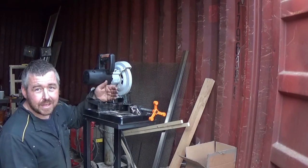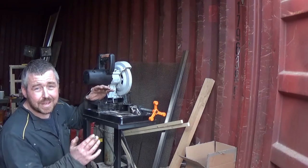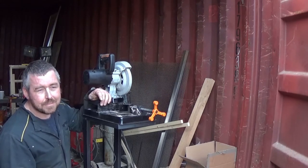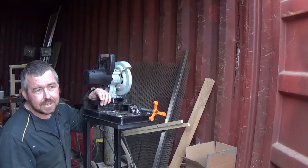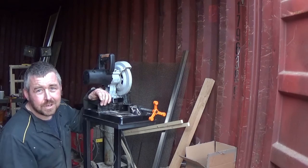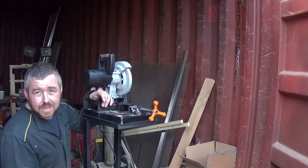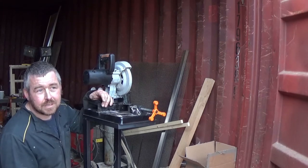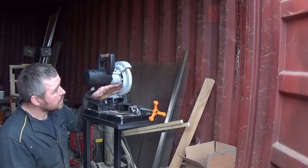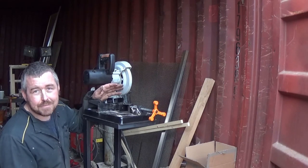The blades, when they're new, and it's only when the blade is new on the abrasive wheel saws, are capable of cutting the rated 90 millimeters, I think. They won't quite do 4-inch, but 90 mil. So you'll only be able to do that with a brand new blade. As soon as that blade starts wearing, you can knock off however much the blade is worn from your cutting specs basically. So when the blade's halfway through its life, it will only cut as much as this saw, because this blade never wears down. The teeth will wear, but it won't affect the max depth of cut, for instance.